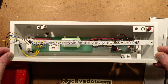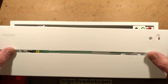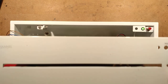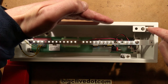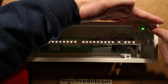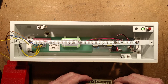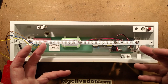This also has automatic test functions built in. Before I go further, I should show you that this is the cover for the front, which has the slot for the sign to go in with a couple of bolts, and it lines up over the LEDs. The test button and indicator go through the front. The test button can be used for multiple tests — a brief press just lights it up for the duration. On a modern installation you'll have a little key switch used for briefly turning the power off to actually test all the emergency lights.